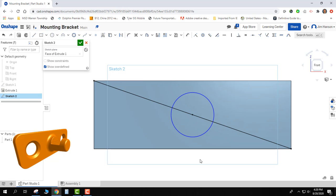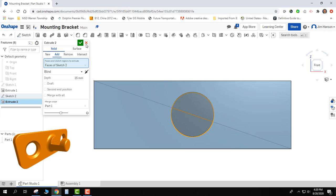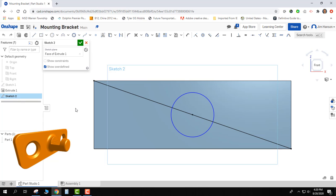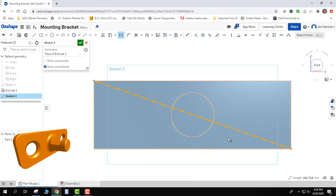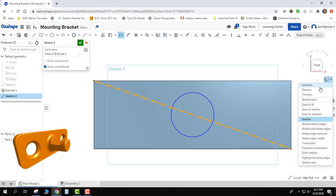There's something a little bit tricky about that line: when I go to extrude, it sometimes sees it as multiple faces and can cause problems. So I'm going to click on this line, right-click on it, and go to 'construction.' When I do that it turns into a dash-dot-dash, which hides it from any 3D features. It's still there for me and will keep my circle locked into the middle, but it won't interfere with the rest. That's not essential, but it really helps. I'll go back into isometric and finish that sketch.